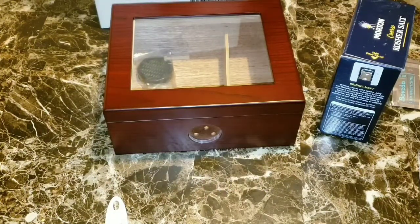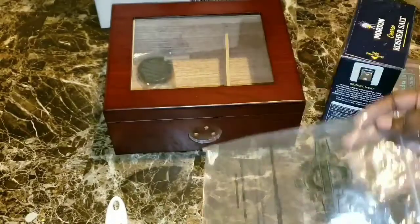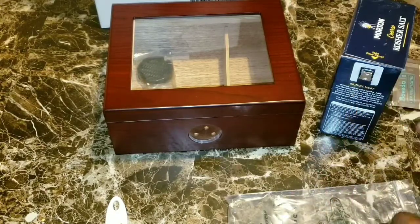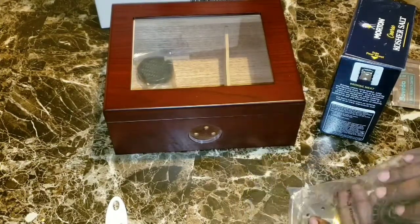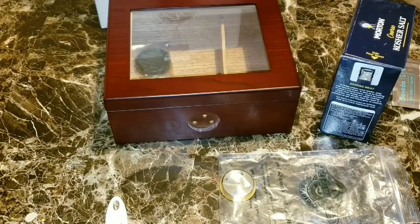75% humidity is how you know your hygrometer is perfectly calibrated. What we're going to do is insert it into a plastic bag that you can seal — zip it up, turn the hygrometer face down so the holes are exposed to the air in the bag. Now what you're going to want to do is get a teaspoon of salt.